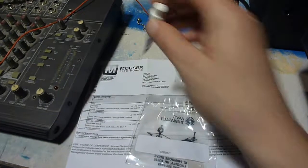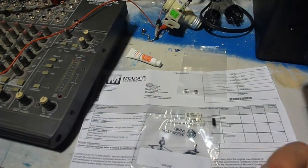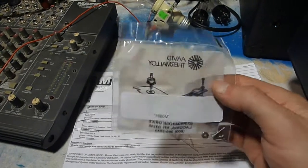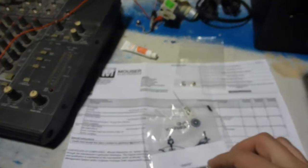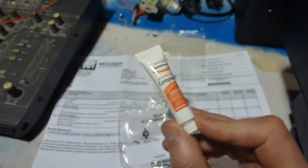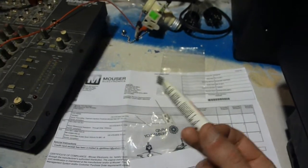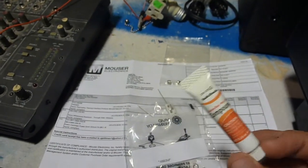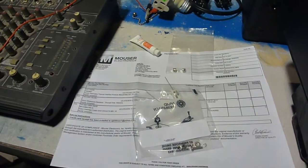So in order to put this one in, I have to use a thermal compound because it doesn't kind of hug the metal the same way the silicone spacer would. I believe mica ones actually work slightly better, but they require the thermal paste. You can't just put them in by themselves. It's important to use a non-conductive thermal paste, just in case a little bit spills over, since we're dealing with some pretty high voltages. Something too close could cause an arc in there. So I'm just going to go put all these things in and then give the amp a try.